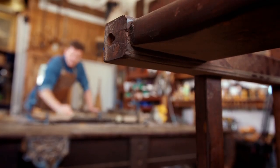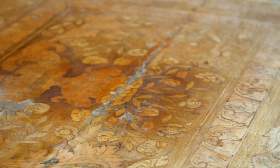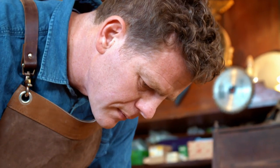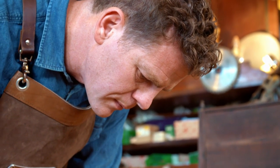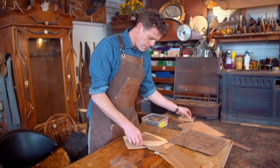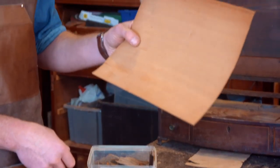In Alex's workshop, the pair of 18th-century Dutch marquetry tables are undergoing a serious cosmetic facelift. Having taken drastic action with one of the tables by splitting it in two, Alex now has to make good on the damage. What I've got here are lots of different timbers — burr walnut, maple, pine. All these different timbers have different colours and different characteristics, which we match to the original panel so that we can lose this crack.